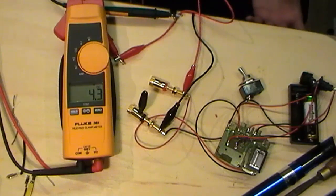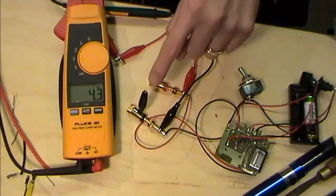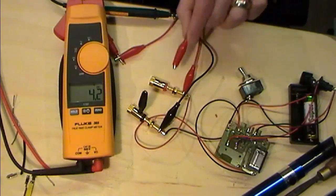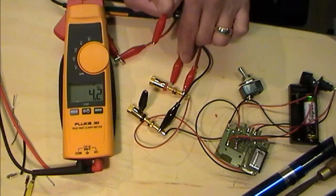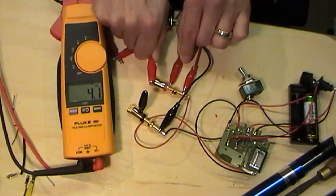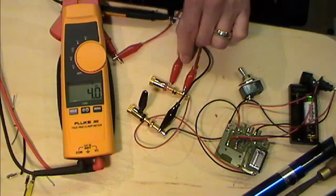We're gonna get some wire and make a spark. But effectively, I've already got my negative end on here, which will hold one piece of wire. I simply need to attach another crocodile clip to my pos pin to hold the other piece of wire, because I don't want to be doing it in my hands. And then by touching the two together, which is where you get your spark, where you get your arc, and where you get your spot weld from.